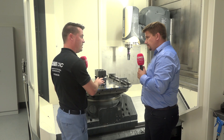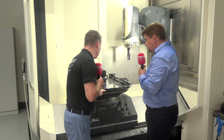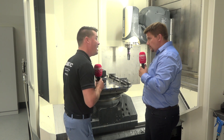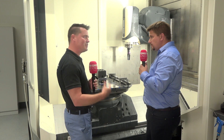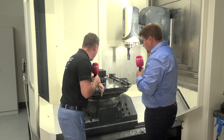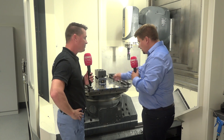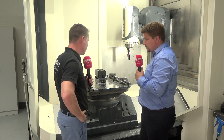Even on smaller machines, I've heard the complaints — usually there are two screws instead of one, and then you have to go to the back of the piece, which can be a hassle. We're reducing all of those movements to one spot, which covers everything all the way to the back of that one line. That's right — up to five clamping pockets, almost one meter, so also very ideal for 3-axis machine tools.